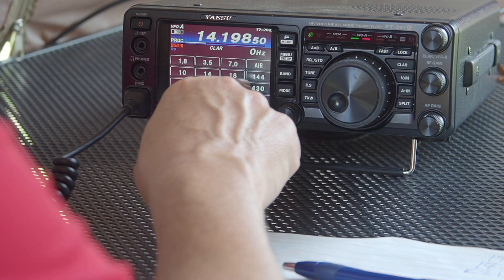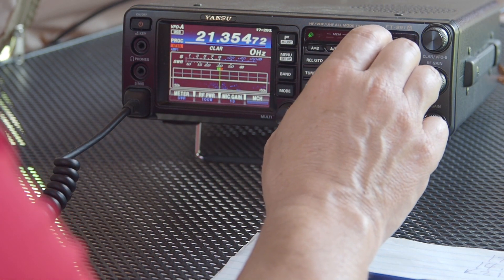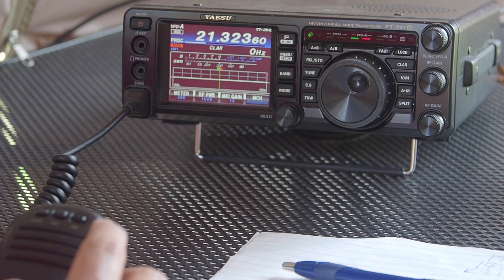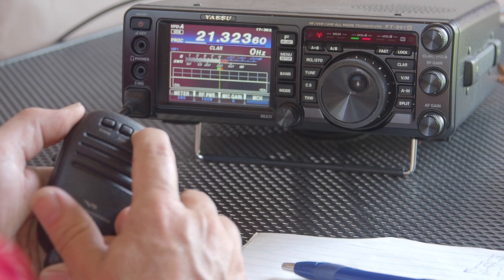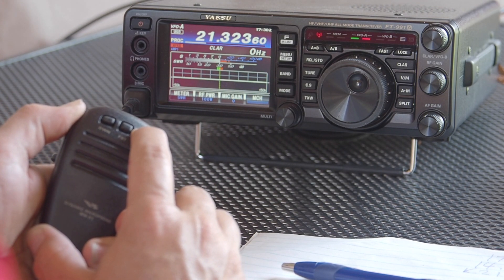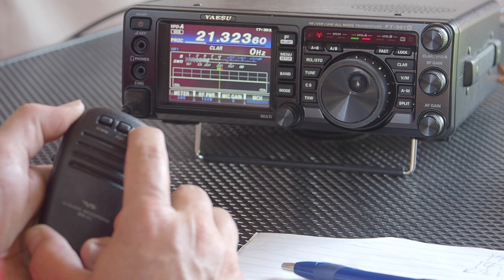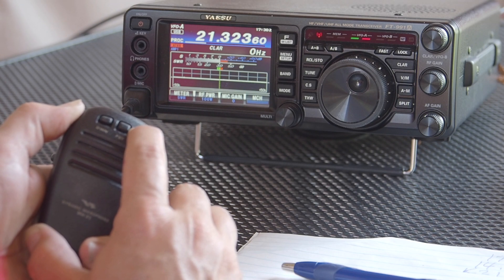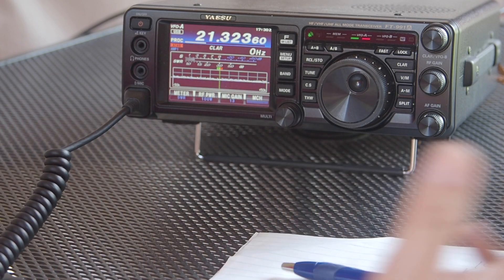Let's try a different band. Let's go to the 15 meter band. We're at the bottom of the solar cycle so the bands are quiet, but let's give it a try. We key down the microphone, hold the up button and hold it until the unit finishes tuning. You can see the ATAS flashing red light there on the left-hand side near the top as it does its cycle. And there we go — just about through, and a one-to-one match. Perfect.